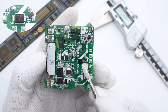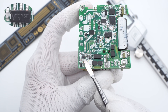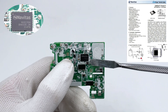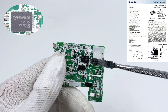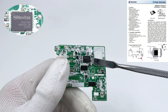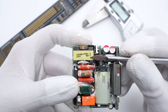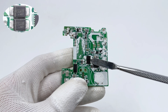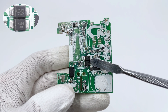Flipping to the back, a TVS diode suppresses induced voltage. The PFC controller is from ON Semiconductor, model NCP1623. The GaN IC for PFC boost is from Navitas, model NV6136A, in a QFN 6×8 package — it integrates driver and current sampling circuit to eliminate sampling resistor losses, with switching frequency up to 2MHz, 170mΩ, 700V. The PFC boost inductor is wound with litz wire to reduce high-frequency losses. Two PFC boost rectifiers are ultra-fast recovery diodes connected in parallel, rated 600V 3A.